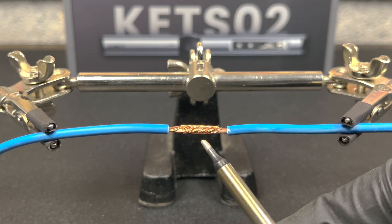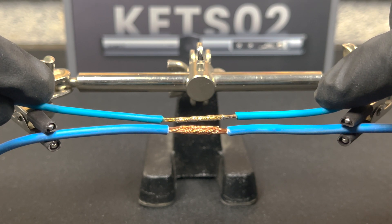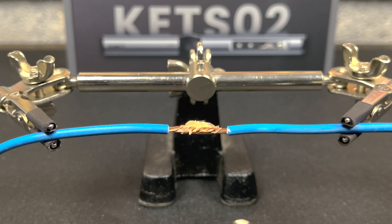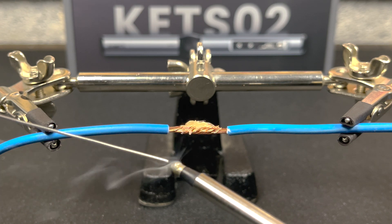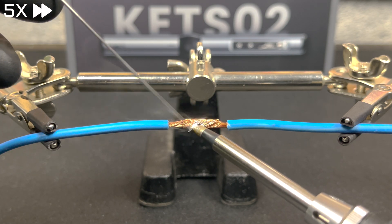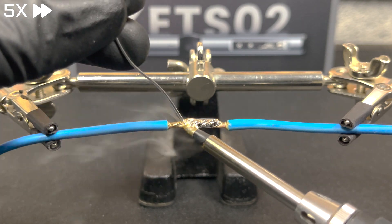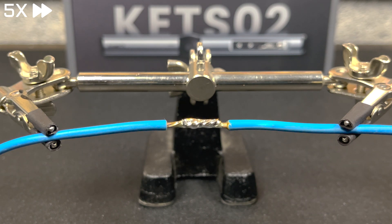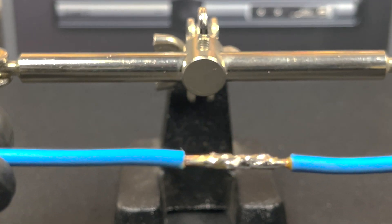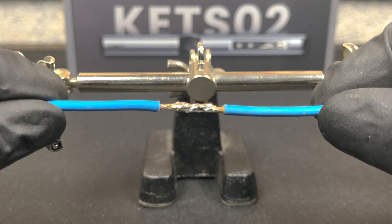As we're going to demonstrate in the next test, using a different tip makes a huge difference. This is the small hoof tip we've been using, and now we're going to use a bigger hoof tip that comes with the set. Although it is a different color wire, it is the same size. We're going to add some flux, then create a heat bridge to get it going. You can see that it is heating up a lot faster than with the small hoof tip. It is clearly not the case that this soldering iron is underpowered — you just need to use the right tip. The smaller tip took about four times longer. Looks like the solder managed to get all the way in there and spread out nicely. That's definitely a strong connection. Another test passed without problem.